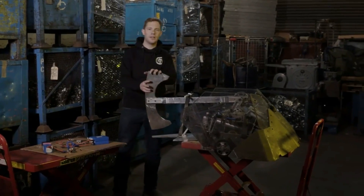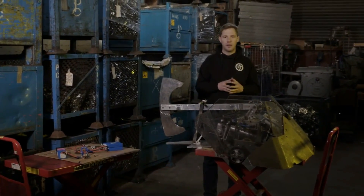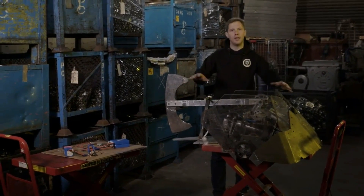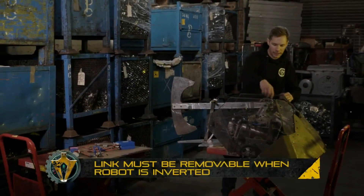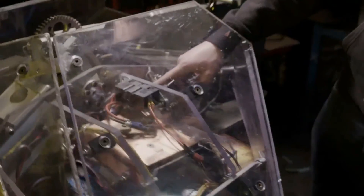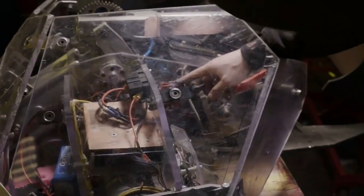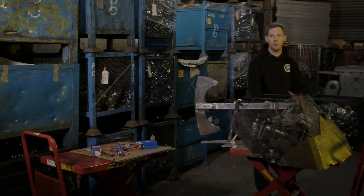Let's take a look at Terahertz now and see where the link and the power light are. An important factor of the link is that it can't be in the way of weaponry. Terahertz's axe comes over the front, so the link couldn't be placed there or anywhere around the front. John's positioned it at the back, out of the way of the main firing arm and the drive system. The power light is behind one of the clear polycarbonate panels, so we can see it clearly. As soon as the link goes in, the power light comes on so we know it's armed.